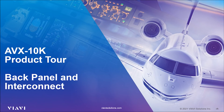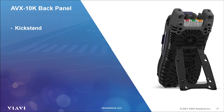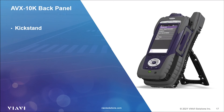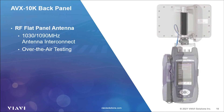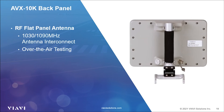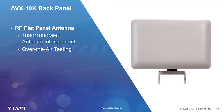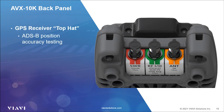Let's review the back panel and connections. Turning the unit around, you will notice a built-in kickstand, which is ideal for the bench or setting the unit on a cart during testing. At the top of the two horns, you'll see two square slots. This is where you will attach the 1030–1090 MHz RF antenna for radiated or over-the-air transponder and TCAS testing. On the top and towards the front of the unit, you will notice a top hat. This is a built-in GPS receiver to sync the GPS timing and capture your geographic location for ADS-B reported position accuracy testing.